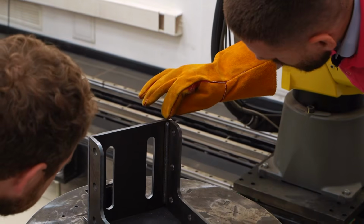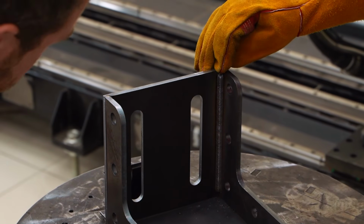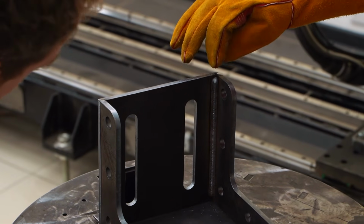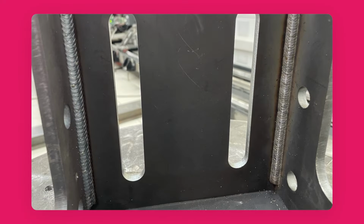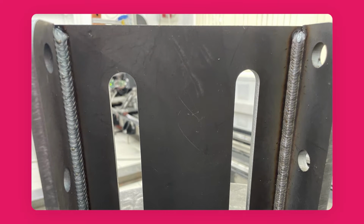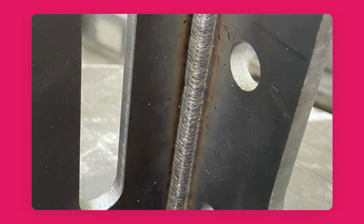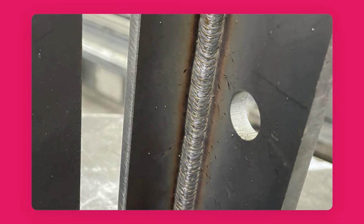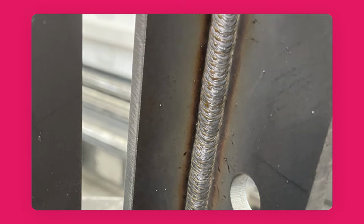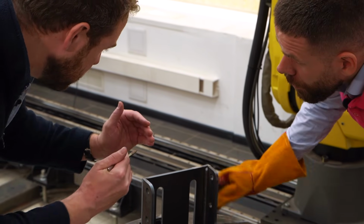But here we have actually a difference. First, the convexity of the seams is different. This seam is more convex, and this is less convex. This one is interval welding. This is because in interval welding you don't have these weavings. You just stand in the center of the seam, and the amount of metal which is floated away is bigger or smaller. There's more in the middle.